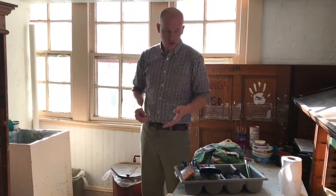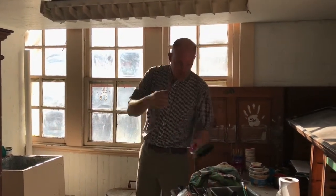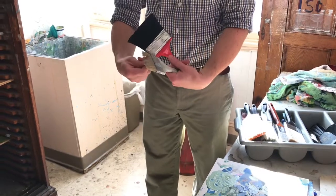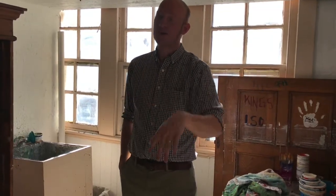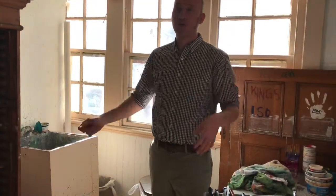I've had these paintbrushes sitting out for the entire semester. If you find they're used and crusty, grab another one or let me know. There are different types you should be aware of. Here are two different types: this one is pretty thick and bushy and smooth, while this one is kind of wiry and not as bushy. The thinner of the two is called a chip brush. I actually like painting murals with chip brushes — they cost about a dollar and are dirt cheap. When they get clogged up, throw them away. But if you need a crisp, clean line or to edge your painting, don't use a chip brush. If you're just covering a wall, grab a chip brush, use it up, and throw it away when you're done.